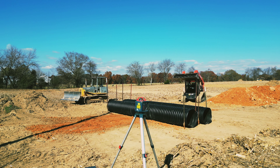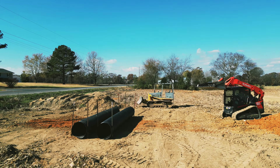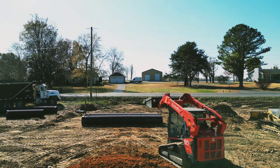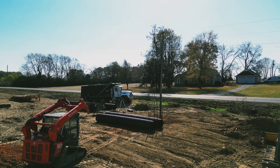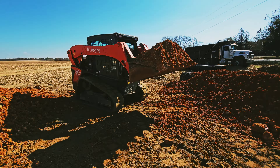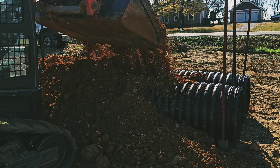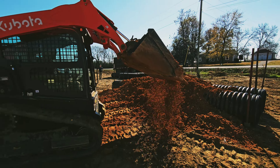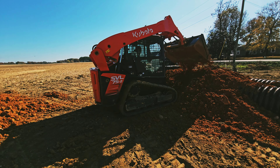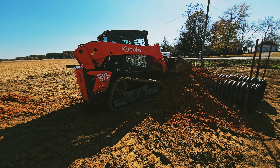Here's my transit. I got these culverts set with about two to three inches of fall — those are 20-foot long, so about two to three inches of fall from one end to the other. We used fence posts to keep them in place, then I put chert in around them with a skid steer and packed it down.